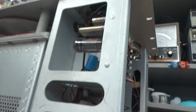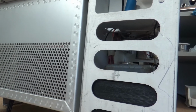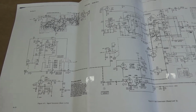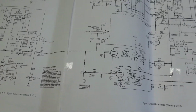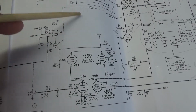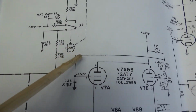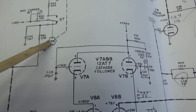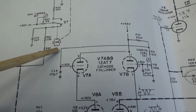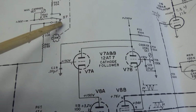So with that said, let me clear up the bench, get this thing ready for setup, get the schematics and all that, and I'll bring you back. Okay, about the time I hit the record button on the camera, the air conditioner came on. Anyway, what we think I have going on is this section right here. And what we have here, if you look real careful, is that you see it says cam. This is on the range switch, okay? So this is a cam right here, and I'll show you that in a minute. But there's a micro switch, a 3-pole micro switch right there.